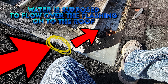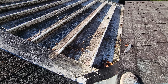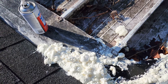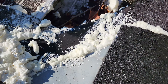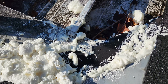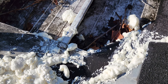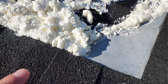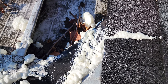That could be caused by a number of things — objects hitting the roof, animals, things like that. All we have to do is seal that area to make the water flow properly again. You can see where that also has some problems there. I'm gonna make sure I get this whole area really good. We got our Walmart spray foam here, perfect for this. I'll seal up around where the flashing was and also not block this flashing so the water can still flow down through the gutter.